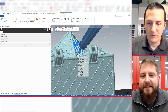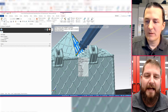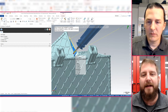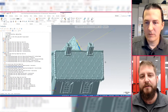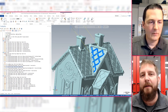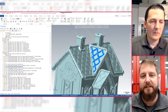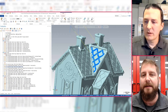It keeps it very flexible because it puts a lot more toolpaths at your fingertips. Some of the toolpaths, even the legacy ones that we like to use that give us a desirable finish and a desirable motion — I know how this tool is going to react going through all this. It's going to give us a beautiful grain structure to what we're doing with this icing or snow on here. Being able to use just our simple three-axis path and not put too much into it. Start at the basics and worry about cut pattern first and foremost — that's what we went with here. Let's get that cut pattern nailed. Then it's a few clicks of collision control and doing some auto tilting. Don't hit this chimney now, and it gets to keep my cut pattern in place. I'm just going to roll around on that ball to still achieve the same cut pattern.